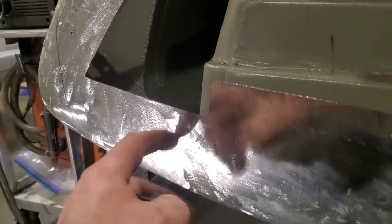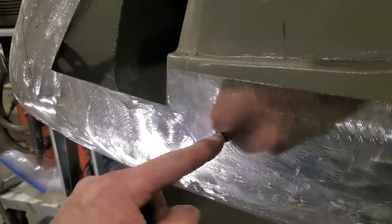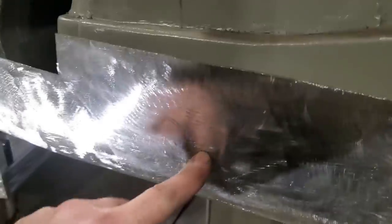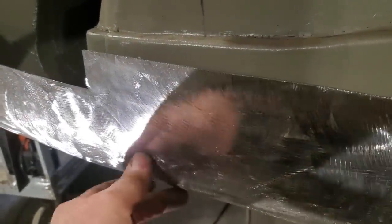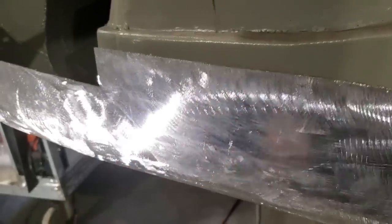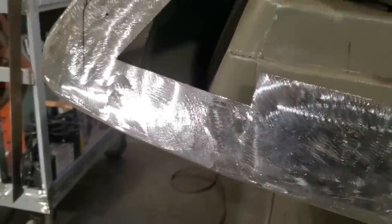It's very hard. We're in a small area and you're doing a lot of welding. Rocker panels especially, you're welding a piece in a rocker, and you're welding in a small area. It's not like I'm welding up here and then coming welding down here. I'm just welding up, welding across, welding down. Then you wonder why it happens. That whole area has gone hot on you, so it's going to pull on you. But anyway, we all make mistakes, we all have issues, and even my metalwork is not always perfect.